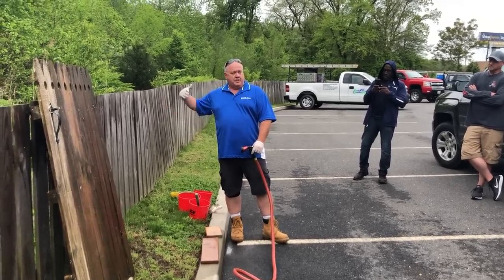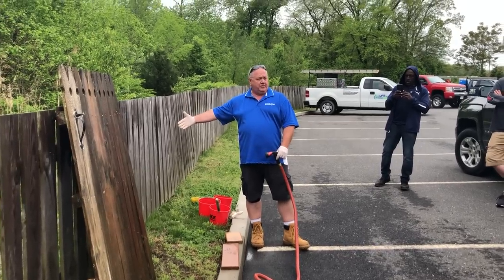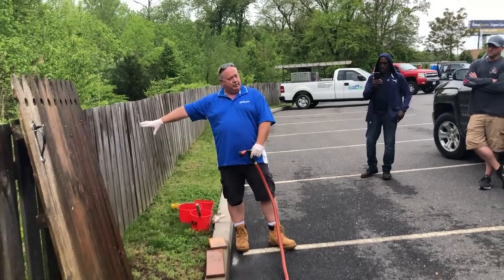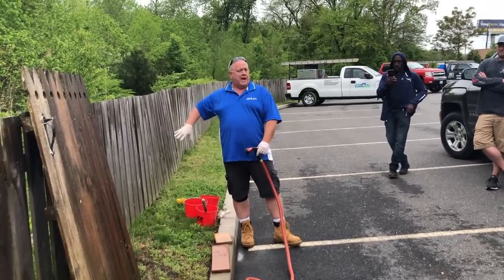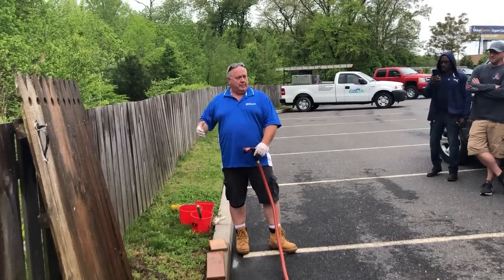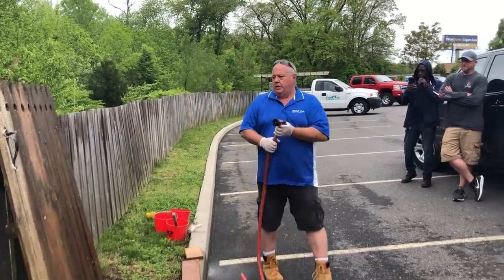So if you go back and look at that in 6 months or a year, if they've sealed it after cleaning it by just putting it on dry wood and not getting rid of the gray wood fibers, you'll see it all blotchy, because some of those gray wood fibers will come away from the wood. So the best thing to do is get rid of the wood fibers.